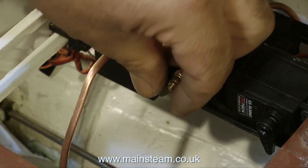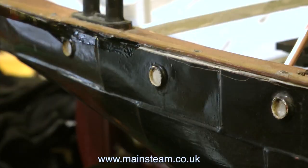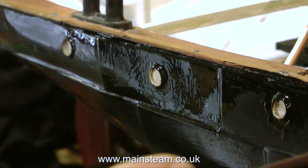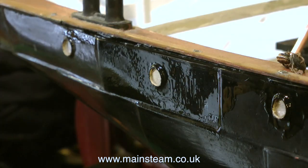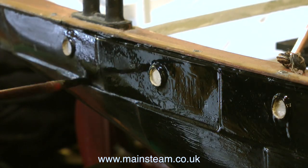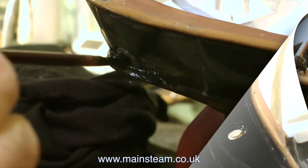It's not a good idea to fill the bottom of the boat with gas. And at this point, it's painting time — but while you're watching this interlude, it is extremely important never to open the gas valve and let gas go into the inside of the boat. If you do, it will just lay there waiting for an ignition source, and when it gets one, all the superstructure parts will blow off.